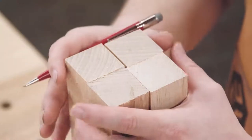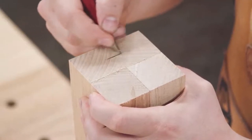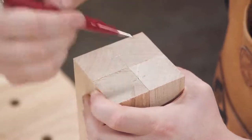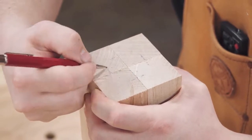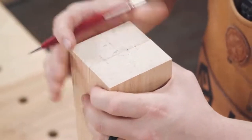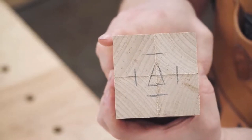This material is just leftover from the table build, which means I didn't really have a choice about grain direction — I just had to use what was available. But as it turned out the leg blanks were 100% perfect with matching rift on grain all the way around. I could not have gotten any better even if I tried to pick out stock — definitely a happy accident. Here I'm marking the location for each of the sliding dovetails as well as a carpenter's triangle in the middle to instantly identify where each individual piece belongs at a quick glance.